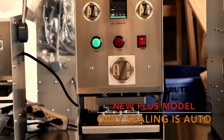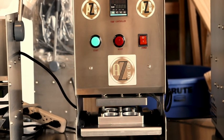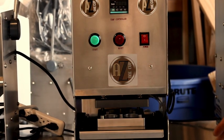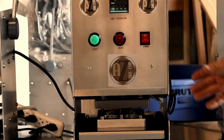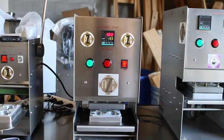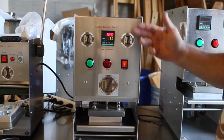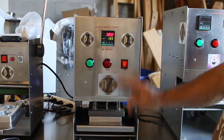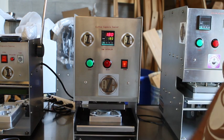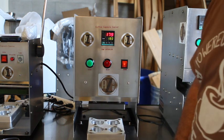Because there's a substantial difference in price between the manual and the semi-automatic, we decided to come up with a system that didn't cost as much — save you several hundred dollars — but basically did the same thing as the semi-auto. So you push the tray in manually, then you hit the start button. The heat element automatically comes down, seals for the number of seconds that you have it set for in the machine, and as soon as it retracts, you pull it out and repeat the process.